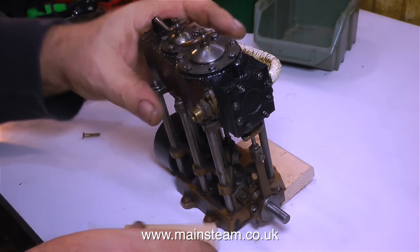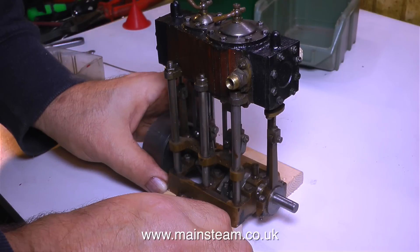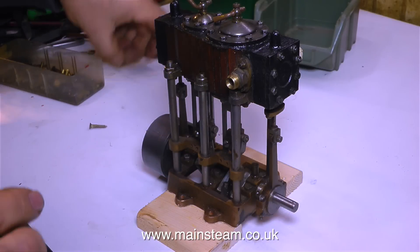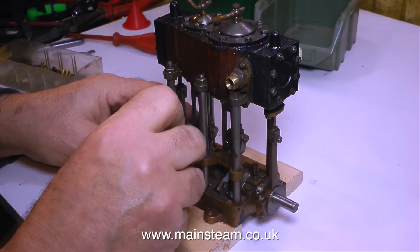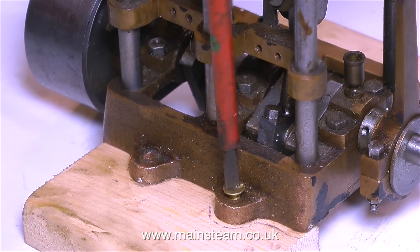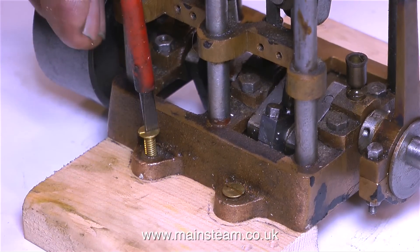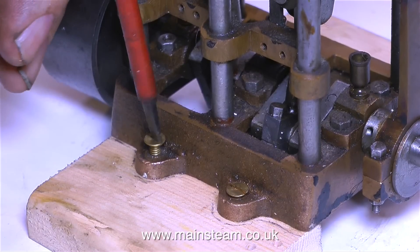After I've turned the engine round, I'll repeat the process on the other piece of wood. Instead, I'll have a quick word about compound steam engines. A simple steam engine is one that has two equally sized cylinders. Steam is admitted to and from each of these cylinders by two slide valves, one for each cylinder. As the steam is admitted and exhausted from each side of the piston, the pistons go up and down in each of the cylinders. Steam goes into the steam chest, it's admitted to one side of the piston, it moves the piston up, and then the steam is allowed to escape to exhaust as the slide valve moves to the exhaust position for that particular cylinder. It's quite difficult to explain, but once you know how it works, it's very, very simple — and this is happening for each cylinder.